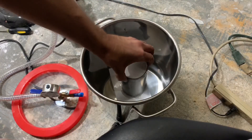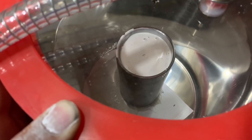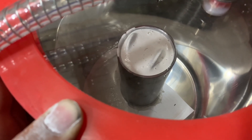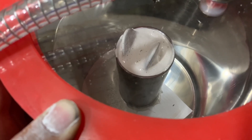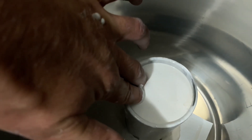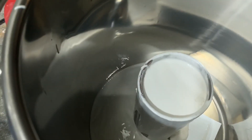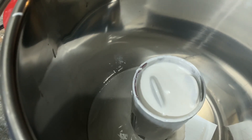I'm also testing my new vacuum chamber to make sure there are no bubbles in the investment. But there must have been some bubbles in the wax base that I made, because the vacuum sucked the wax up to the surface. I tried pushing it down and had to start over — story of my life.